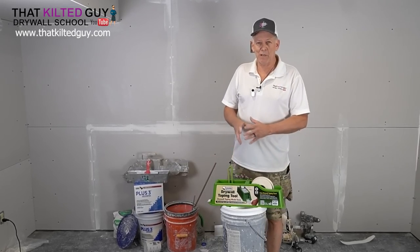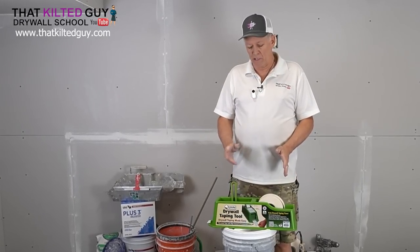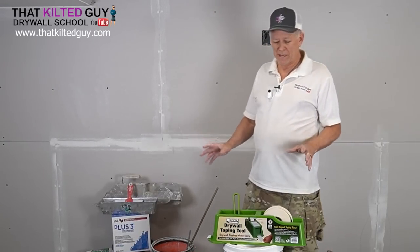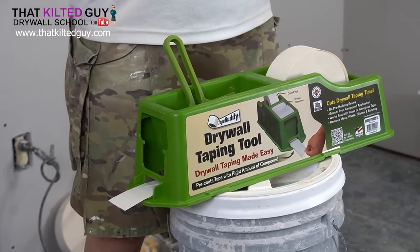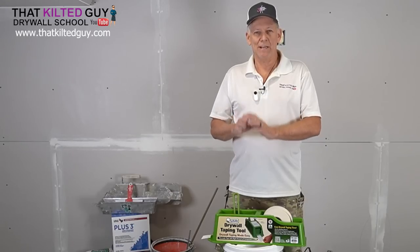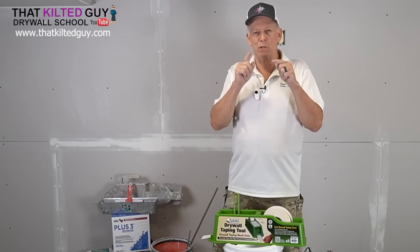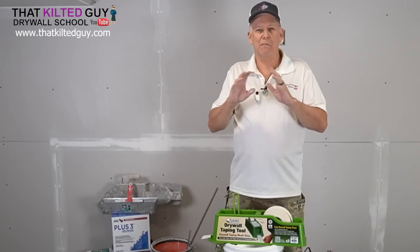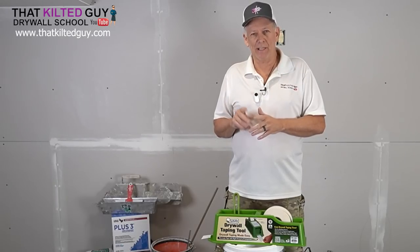This is something you can use regardless of your skill level. If you've never spread mud before, you don't have to know how with this. You do not have to know how to spread the mud on the wall or lay the tape in it. It's got a setup where when you pull the joint tape out, it's going to put the mud on for you — nice and even. It's designed to put it a little heavier in the middle, giving you a nice perfect base of mud. Then all you have to do is wipe it and get it to adhere to the wall to bed the tape.